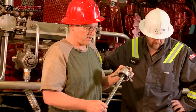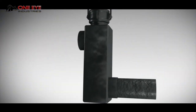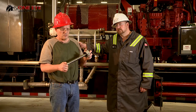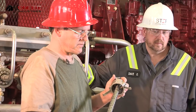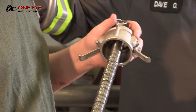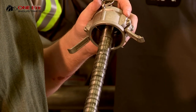Lube oil scrubbers are nearly a zero pressure drop device, making them well suited for situations where restriction in the suction system cannot be tolerated. If the suction scrubber magnetic element is pulled daily, operators become familiar with its appearance. If the characteristics of the particles attracted to the magnetic filter change, it can be used as a daily predictive tool to decide whether the pump is good to run or has been damaged.